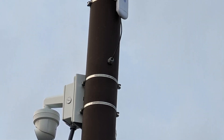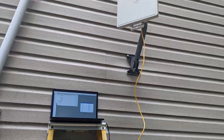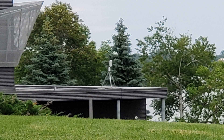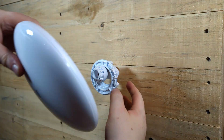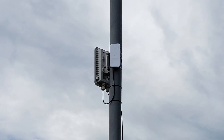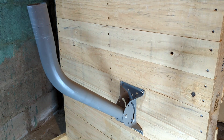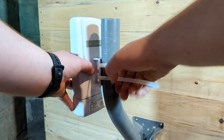Mounting the bridge outside depends on the model and the construction of your building. Every situation is different — try to mount to a flat concrete or wood surface like a wall, deck post, or roof fascia. Put it in a spot where you won't bonk your head on it and where its line of sight won't be obstructed by vehicles or other things. Some bridges, like the Ubiquiti NanoBeam, let you drive a long screw through its ball socket mount directly. More commonly, devices are designed to mount to a round pole, so a railing could work too. Otherwise, you'll need to install a mounting bracket with screws appropriate for the surface.